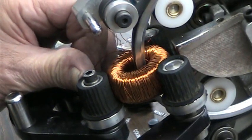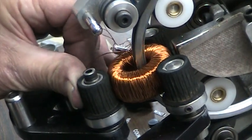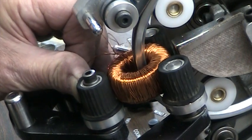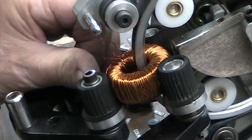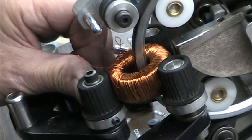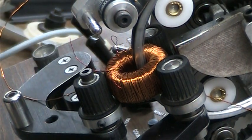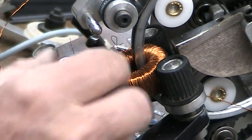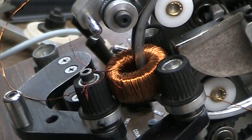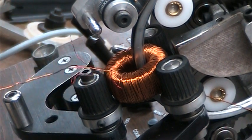We're almost up to 500 turns now — 450 right now. He's got that thumb on the roller, but he really should be adjusting forwards. 480. We ran out of wire. So we should have probably loaded another turn onto the shuttle. There were 99 turns of wire loaded on the shuttle to do those 500 turns.